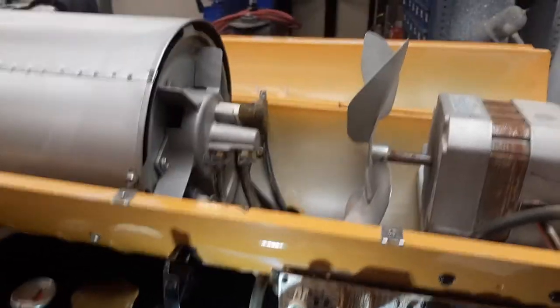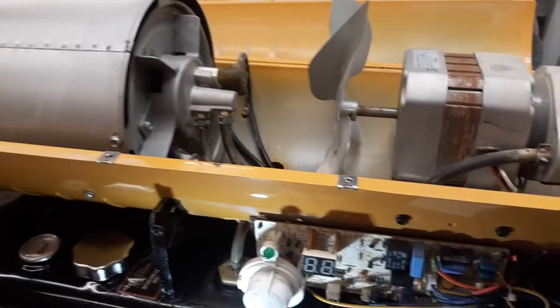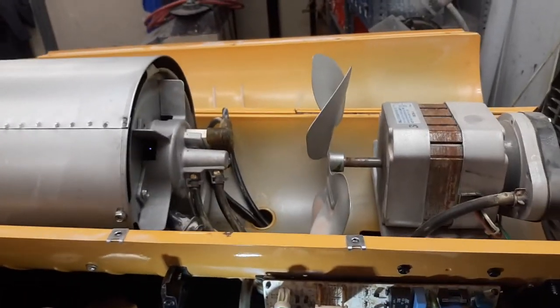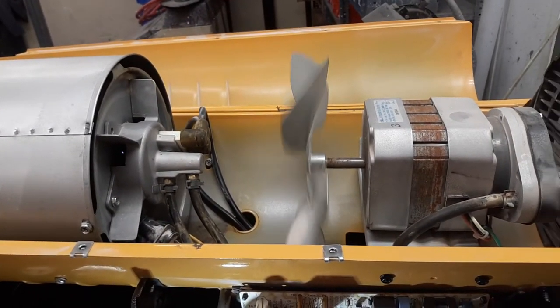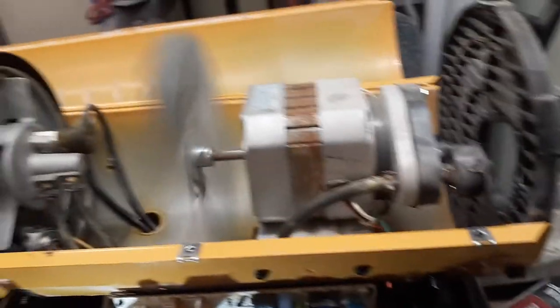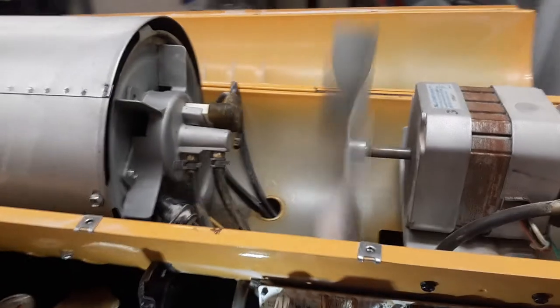The problem with this one is: you turn it on, it runs, never ignites, and then shuts off. We're going to run it real quick so you can see. You can hear the igniter, you'll hear the fan. You can see the purple ignition spark and you can see white haze coming out — that's raw fuel. But it's not igniting; it should have ignited pretty quickly.